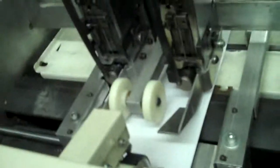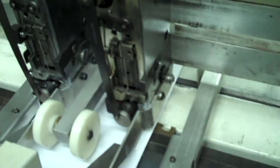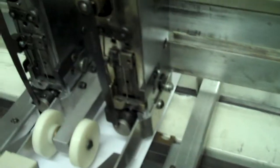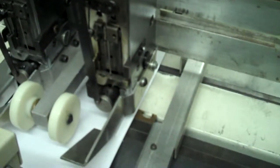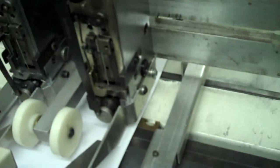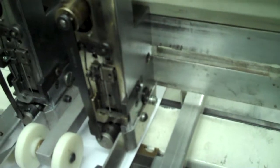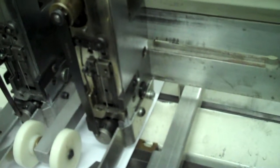Now, what you can do, and I do have customers doing this, is you can run your CD booklets 2 up instead of 1 up. Now, what that would do is it would give you a 9 3/4 by 9 3/4 sheet, which would be a dream running through here, no problem. Or 9 3/4 by 10. Okay. Then what you do is you put 1 staple on each booklet, and then the 2 center stitches, you would do that on an offline stitcher.